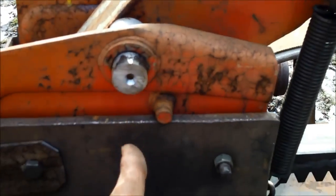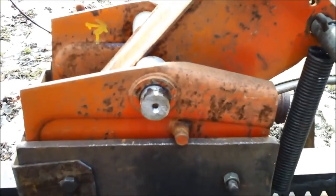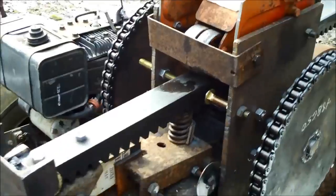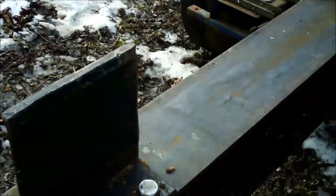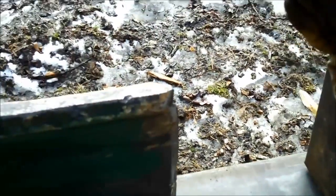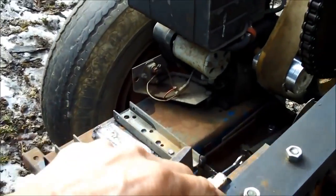It's important that when this is operating, the line between that pinion and the rack are all directly above each other. I also have this set up so I can split a three-foot long piece of log. The rack will actually come out about that far, and that's where it stops. Then a spring actually pulls it back — I'll show you that on the other side.